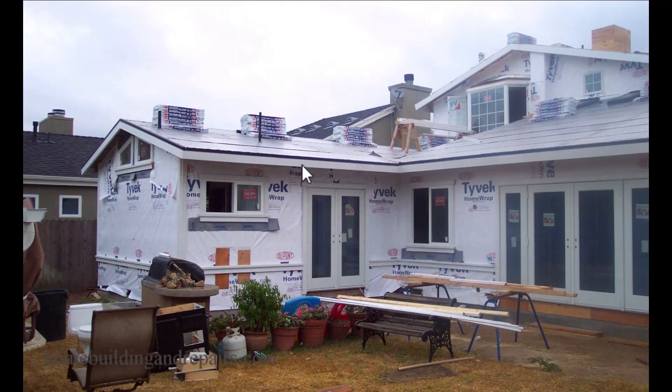I don't think it's necessary to load the roof before you install siding, but it wouldn't be a bad idea to check with your building inspector or local building authorities. On most of the jobs I worked on with siding, I either loaded the roof, finished the roof, or made it a priority to install all of the siding in the areas I needed to before installing the roof.